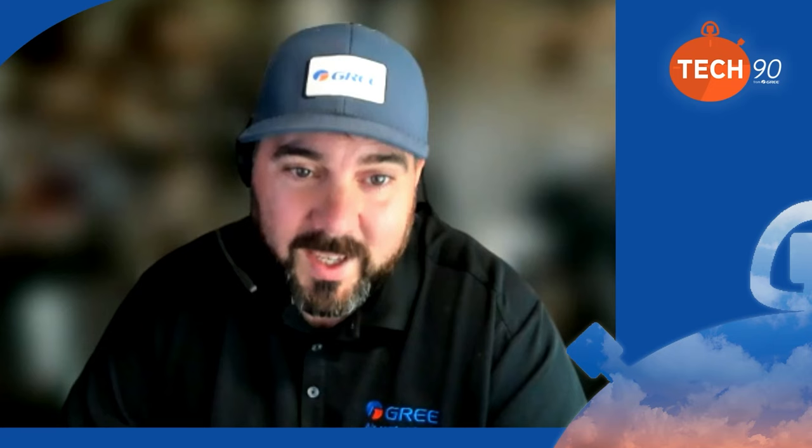All right. One last question here from Drew, and then we'll get back to the video. Does the system have an oil recovery mode or refrigerant recovery mode? It does have both, actually. The oil recovery mode is what I would refer to as oil return, and that is something you will get if you don't set the blower up properly.